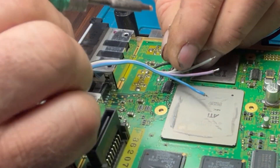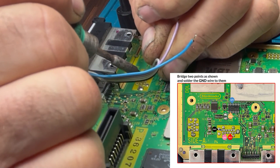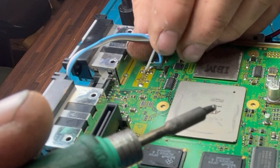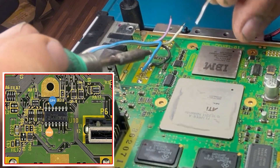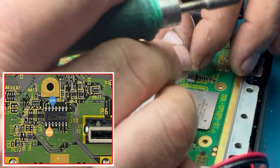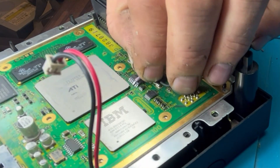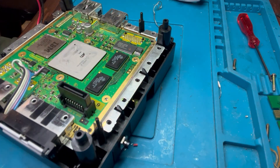There are nice pictures on the tutorial website and the GitHub page comes up straight away in a Google search — the instructions are well documented and nicely laid out. This is probably one of the easiest installs you're going to do if you're comfortable with soldering. There's a chip you have to solder to, and jumper four and jumper six and seven go to specific pins — those are a little more tricky. In this part of the video I used the wrong wire size — I should have gone a lot smaller with copper core.